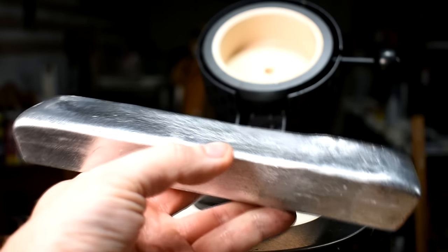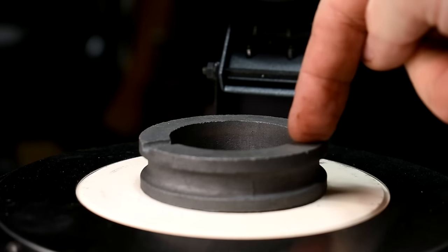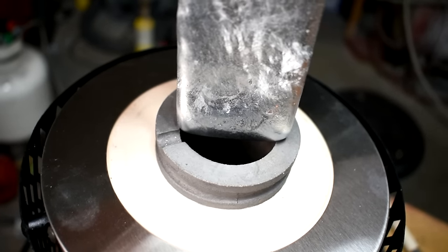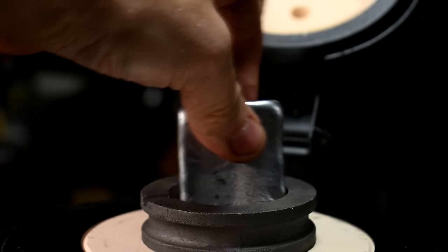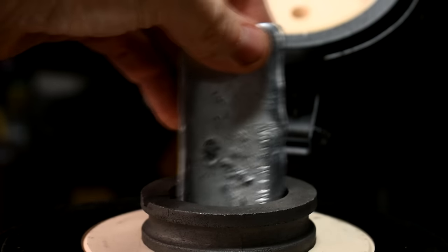Here's where these new ingots come into play. Here's one of the old ingots — the giant four-pounders — and here's one of the new ones, quite a bit smaller. This is the largest crucible that comes with these kits. Here's the big ingot: there is just no way that's ever going to fit in there — you'd have to rip it in half and cut it lengthwise. Now the smaller new ones fit right in with wiggle room. That's important because the metal expands when heating up, and you don't want it to break your crucible. This means you don't have to build a huge furnace just to melt these giant things down into usable sizes. I've even tried cutting them in half — they gum up cutting discs; it's really difficult, harder than cutting a brick of steel. Now I don't have to.